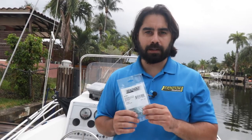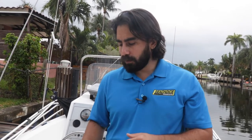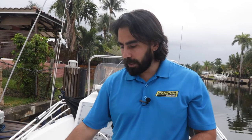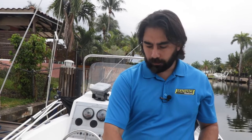Some butt connectors — for this connection I'll need step-down butt connectors. The gauge wire running back to the light is a little bit bigger than what's on the light, so we'll be using these step-downs. Very easy to use, great to have for your boat. Next will be three screws — the screws that were in the boat before were bad so I need to replace them. Some marine grade silicone or caulk. And optionally, I'll go through how I install these: for every electrical connection on the boat I always put on heat shrink tubing. And then a small drill bit — smaller than your screw — and painter's tape, which actually helps protect your gel coat when you're putting new screw holes in.